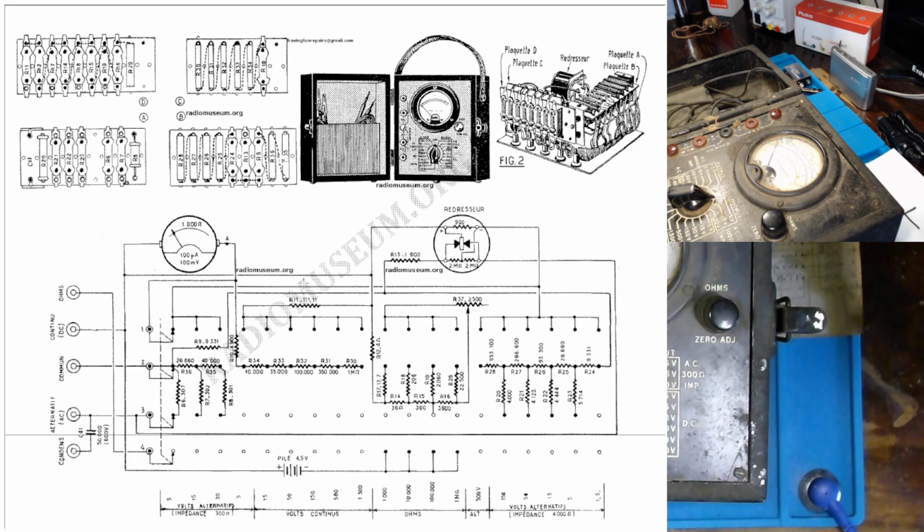Now, my primary concerns: resistors, not too concerned about that. Capacitor, not really too concerned about that. But this network here with our diodes, I'm slightly concerned with. So I'll be definitely paying attention to that, as well as this dry cell battery. Now, unlike wet cell batteries, a dry cell is, as the name implies, there is no liquid per se to spill out, but I could imagine, depending upon the age of this battery, there could still be quite a bit of corrosion. So it's just some things to consider once we open up the device and start digging into it.